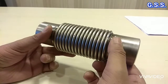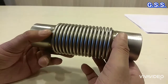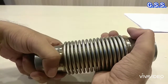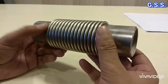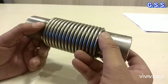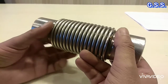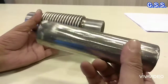If we want to use this bellows only as an axial bellows — meaning it will take only axial compression and axial expansion — then we should not keep this bellows as it is. In that case, the bellows will face other movements, maybe lateral, maybe bending also. So what we should do is provide one pipe piece inside the bellows.